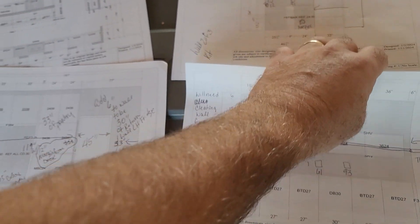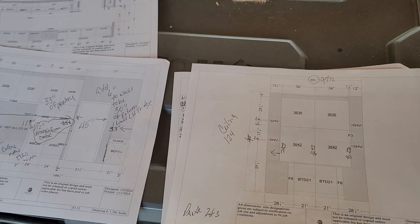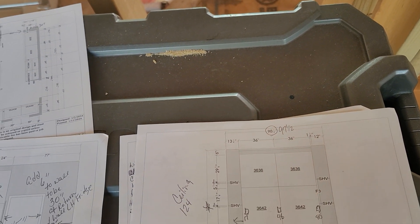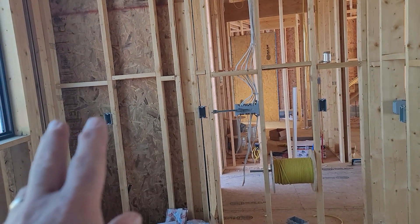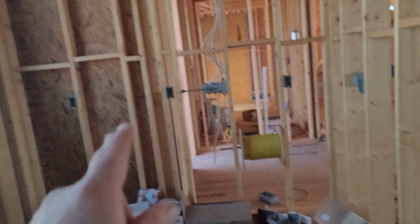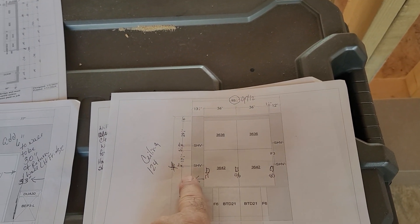This is page two of three of the pantry — the back wall, running left to right. 97 and a half inches is our overall for that wall; it's a little smaller than the plan was. The center lines of the electrical boxes that are here now — they do not have power to them but they've already been nailed up. The boxes are at 17, 48, and 85 from the left-hand side.